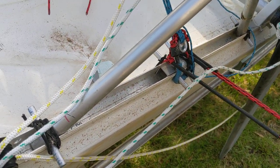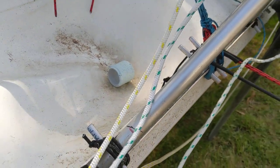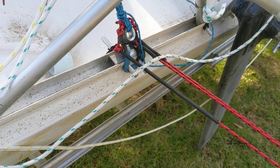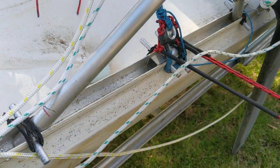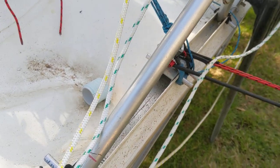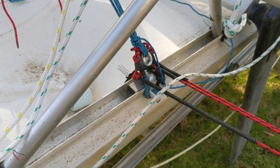The rails are bonded onto the outside of the skin with no through connection, and there are a few layers of glass there painted over. They're bonded to fiberglass on the sides to enable them to stick onto the hull without breaking anything and distributing the stresses that are on these points.